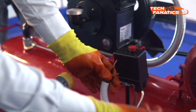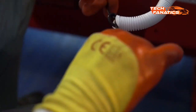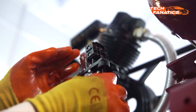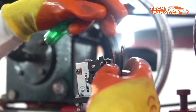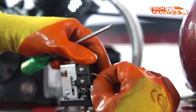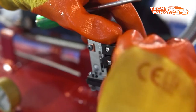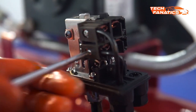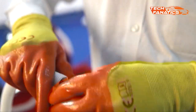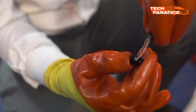We'll take the wire that we have connected to the motor and make a new connection between the motor and the cut-on cut-off switch. Follow the video closely to perform the connections. After that, we connect another free wire to the cut-on cut-off switch which will have a plug on the other end to provide power supply to the air compressor.